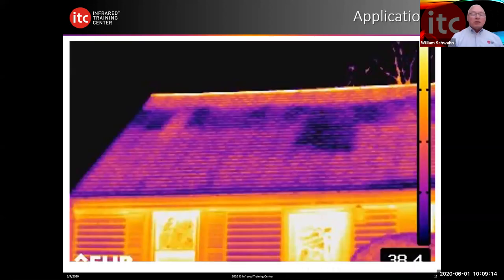This is a good image taken from the outside of a home. You can see there are sections of a vaulted ceiling that may not have adequate insulation — insulation deficiencies. Interpreting the image is very important. Learning how to interpret that image has to do with emitted radiation, emissivity, background reflections, distance, humidity, and ambient temperature. All those things have a bearing on the image and what you're going to see on the screen.